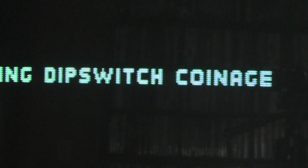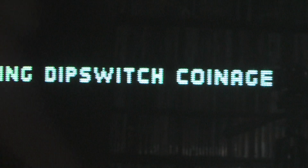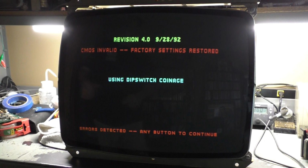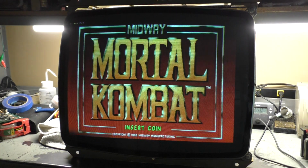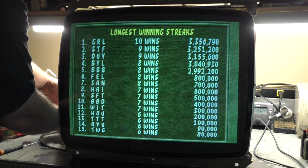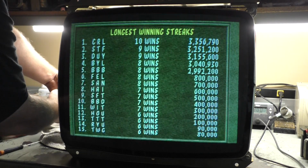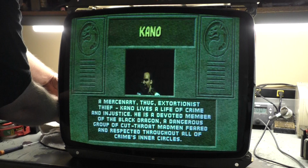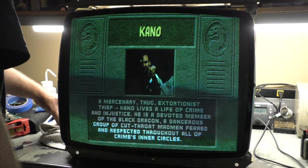Okay. Now we can adjust our focus, which is going to be here. Right there. Glorious. Look at that. Beautiful. All right, now let's zoom back out. Hot damn, look at that. Okay, let's do H position, which is here. Okay, that looks pretty good. Vertical position. That seems all right. Vertical size. Right about there. And now we got to do horizontal size.